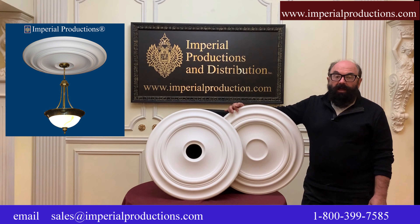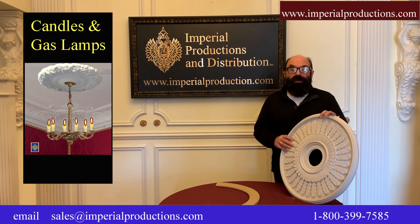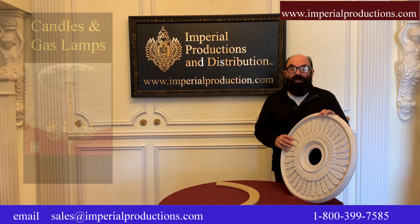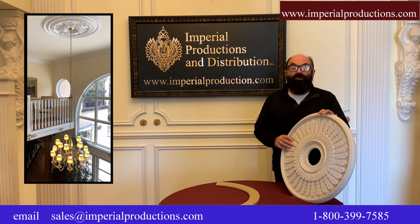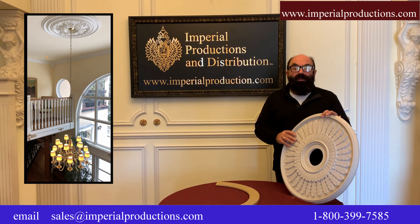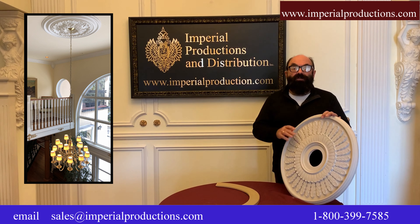It's perfect for any modern environment. Medallions were originally intended as fire barriers and to enhance the look of the ceiling light fixture. Since they're way up on the ceiling, they should be about two-thirds larger than the widest point of the fixture. Always remember, they're way up there, so they look a lot larger here than they will when they're installed on the ceiling.